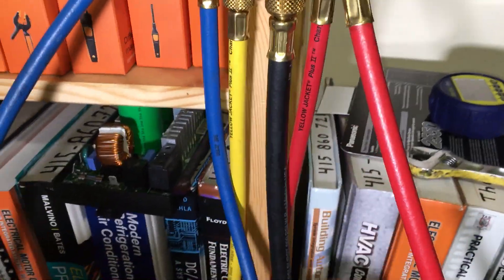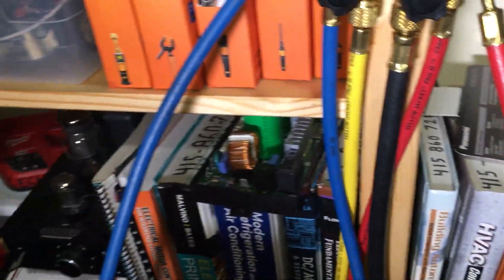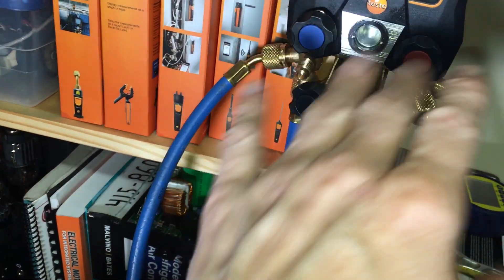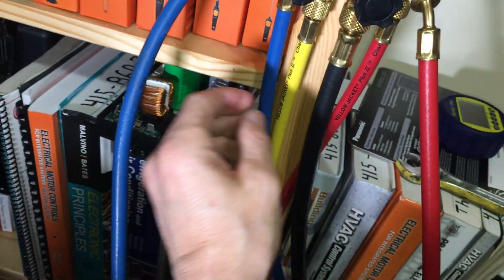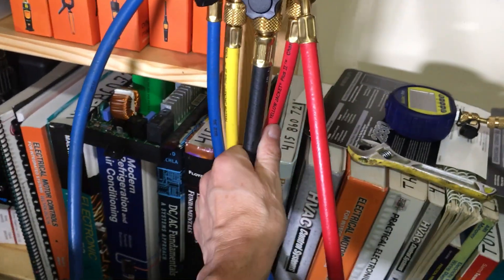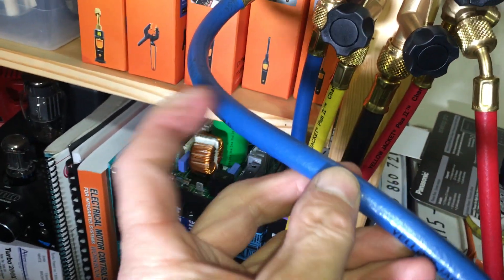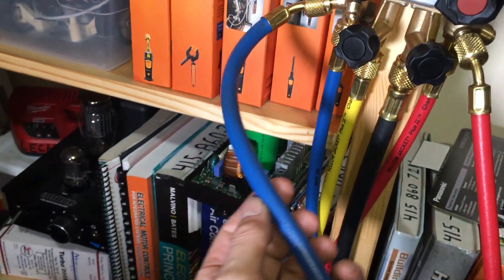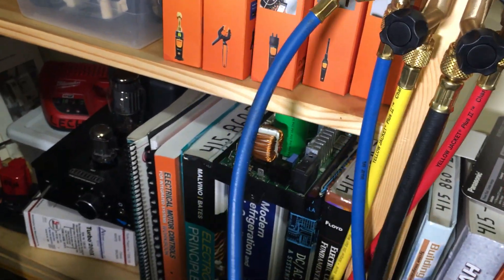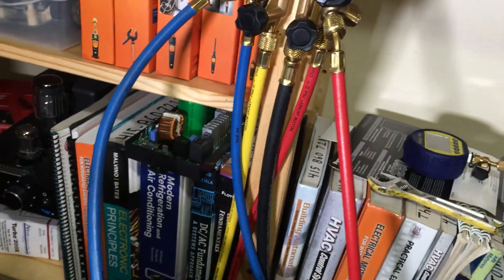I don't see these too clearly on the black hose. Hoses sometimes leak internally because you have an inner lining, then a threaded material, and another outer plastic jacket on top. If you don't have an outgassing relief point, the pressure can bubble up into a big bubble that pops violently — it can hit you in the face or hands. If you have 400 to 600 PSI of pressure when it pops, it hurts your ears too. It's quite a loud crack.